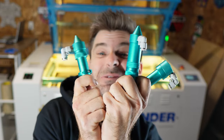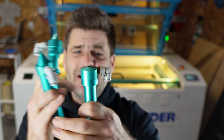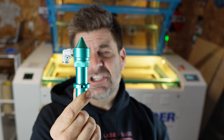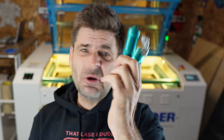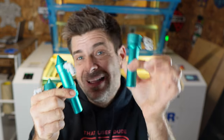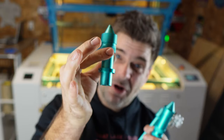I got three lenses with this machine. There's this little guy, then this bigger guy, and then this medium-sized guy with the bull head. This medium one is the one that came on the machine and it's the one I primarily use — it's a two-inch head and it does all my cutting and engraving. I rarely use the other two, but honestly — the four-inch head is for cutting thicker material, and the other is a high-definition engraving lens. They've all got their uses, but the two-inch is the one I use for everything.